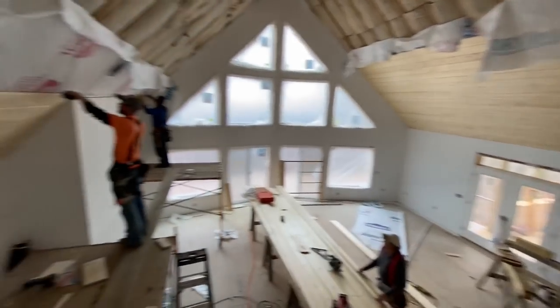If you didn't have that plywood — say it was just all windows and no plywood — you'd have to brace it in some other way. So that bracing, that plywood, that four feet on each side really helps to make this house strong side to side, as well as front to back from the other stuff.